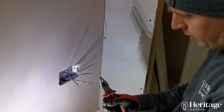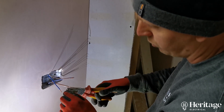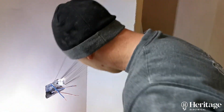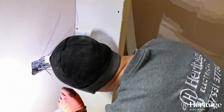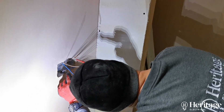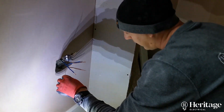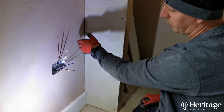If we were using 2.5mm cable — which we're not — I would normally double the connections over to fill the connection out as much as possible, so you're getting a good tight connection. Whether that's in the socket, in the back box, a light switch, whatever — if you've got space to double the connections over we'd advise doing that, as it gives you a tighter connection and less chance of the copper cable slipping around the screw and getting a poor connection. There's the bonding cable to the back box.